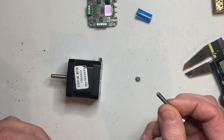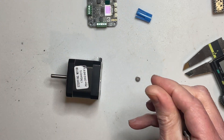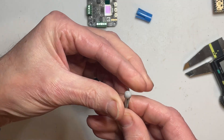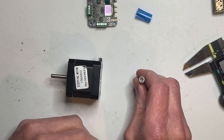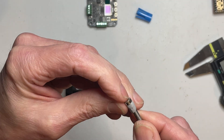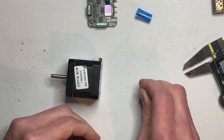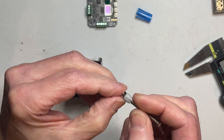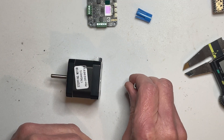It's just a stainless steel screw — it's not particularly magnetic, no matter if it is really. A bit of blue tack type stuff — this is actually watchmaker's putty, but same thing basically; it just doesn't affect watch parts or leave the wrong type of residue. Just do a little blob of that on the end of the screw so I can pick the magnet up with it. Make sure it's stuck down, and mould it in a bit more so it doesn't spread too much when I put it down the hole. I don't want it to clog up in the 6mm hole, but I do want it to be able to push and stay square.